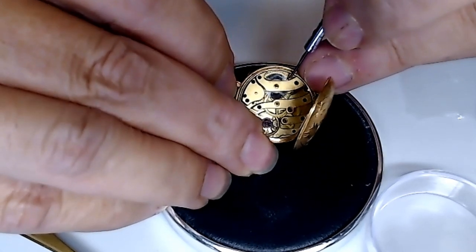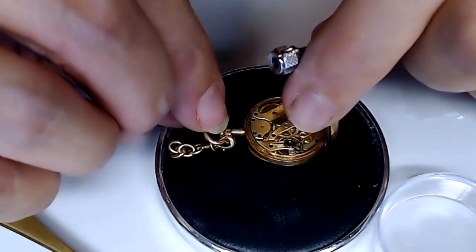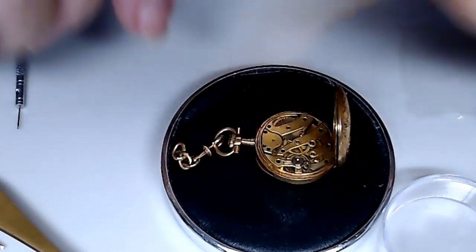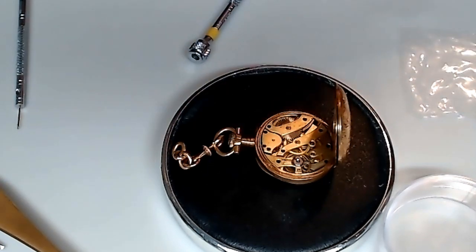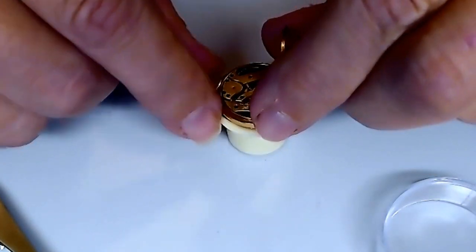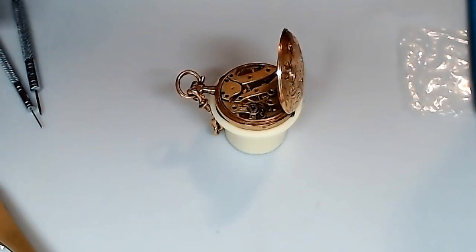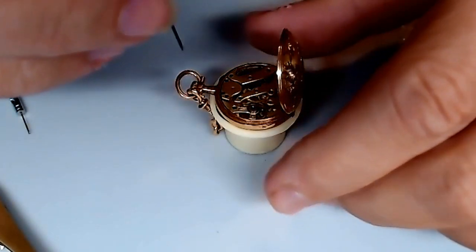This seems to be letting go of the power, which is nice. I very carefully take my thumb away, holding the crown while I push this small lever and deal with it that way. Before I get too deep into this, I want to take some photos for reassembly purposes. I've put the pocket watch on a very small watch holding cone so I don't want the center wheel pushing down — I've got to be mindful of that center wheel pinion bending, and that's where the minute hand hangs on.